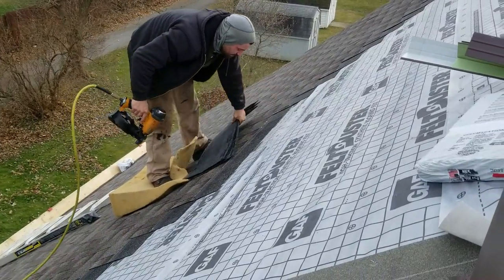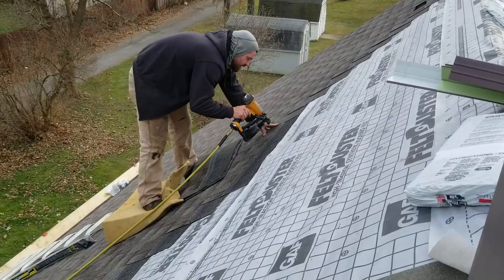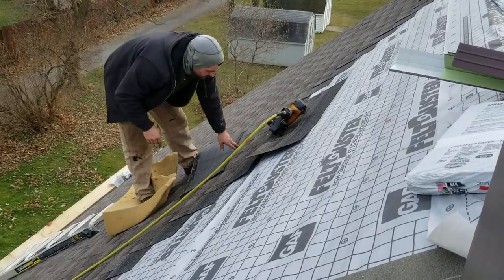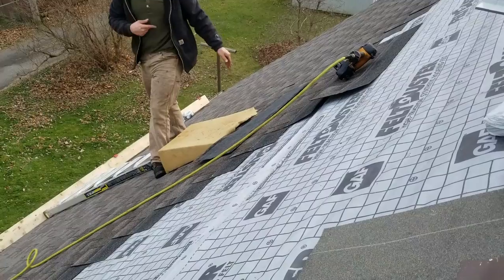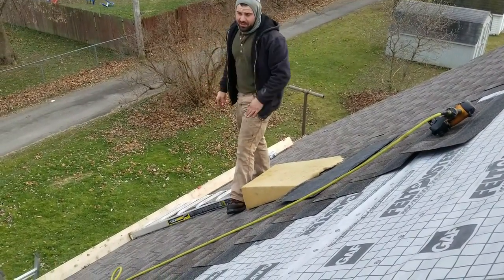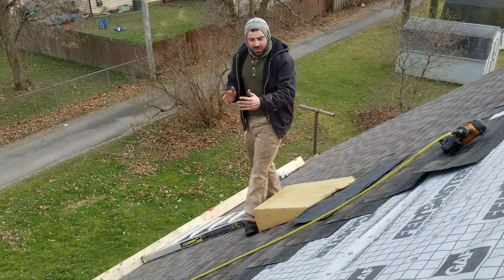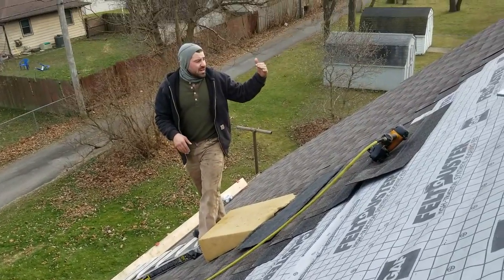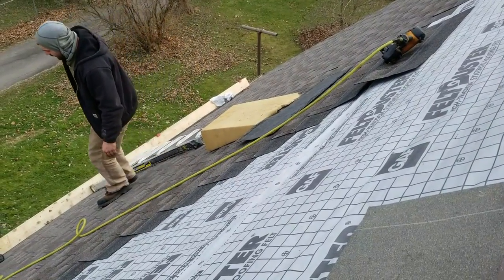Right on. So I just thought of something as well. I'm just trying to show you guys a different way I could be going about this. I ran out of coil, but I ran out of shingles right here. That was just how much is comfortable for me to put on. A thing I could have done was go out that comfortable level all the way across. I'm not going to do it because I didn't realize the board was already about to be in my way. But I could have gone out a comfortable length a few times, like I did on the bottom, and then come up here and had a steady system to get to the very top reach. Could have been another good way to do it.